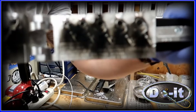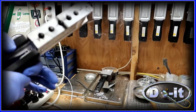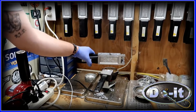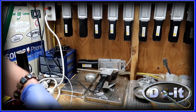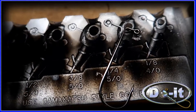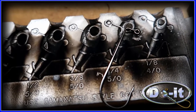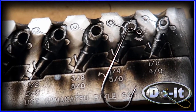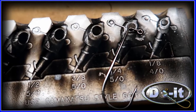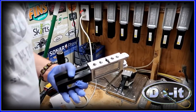Make sure that they're all nice and smoked, then I'm gonna leave the mold on top of the lead and get it nice and hot. I put the wire form in and I put the 5/0 hook in there, and I'm gonna be making quarter-ounce. I know a lot of people go smaller and a lot of people go bigger, but the quarter ounce is the size that I like the best.